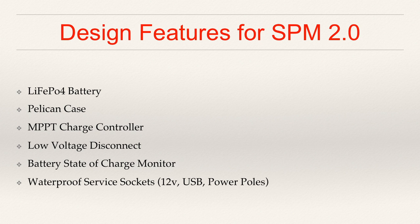This time I will definitely be adding a low-voltage disconnect, and this is pretty much an absolute must-have given that I'm going with the lithium-iron phosphate batteries. Because lithium batteries, if you over-discharge them, you have a lot more to lose. They're not as fault-tolerant to being over-discharged as lead-acid batteries. I stumble there about making a definitive statement simply because I have not over-discharged one and then tried to charge it back to see what the net effect is. But all indication in everything that I read is that it's bad, and you can permanently damage your cells.